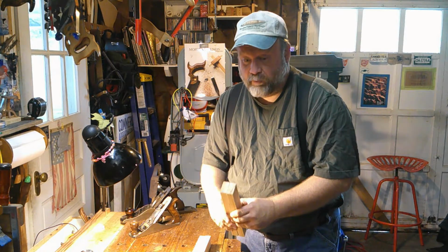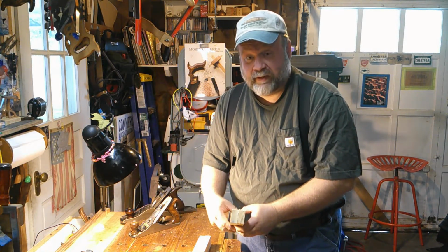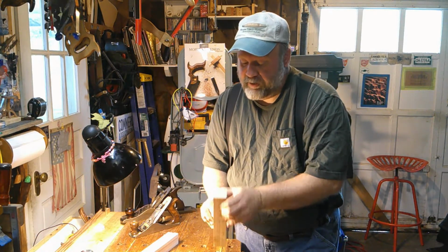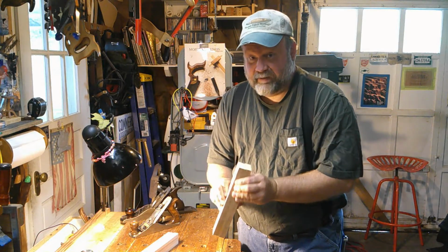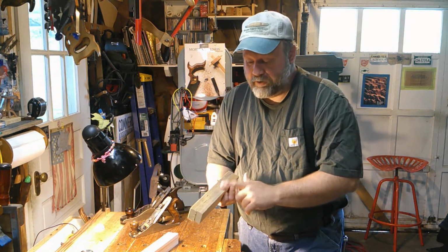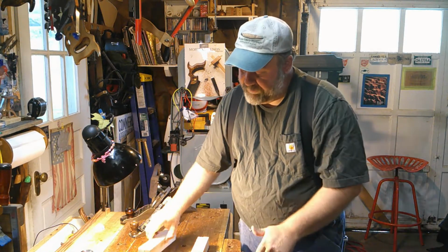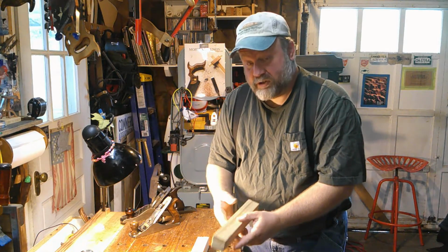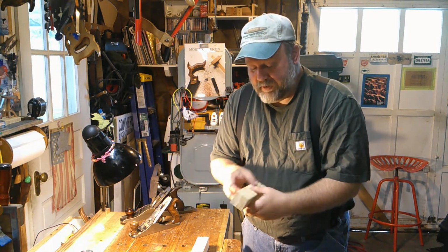Now, because the saw mark, I had a lot of leeway there. 2 of these are going to be roughly closer to the same size than the other 2. So we bring those 2 pieces up. The square flat edge that comes from the lumber mill or lumber yard, we can use as a beginning reference point. So we use those for bottom. We also want to look at the grain direction to make sure that we're not going to be planing against the grain.